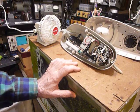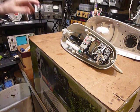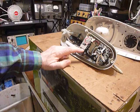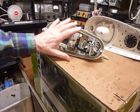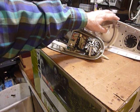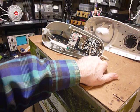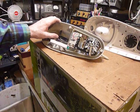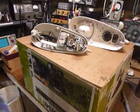So what happened? Well, I'll tell you, when I came down here to get it, I still had the batteries in there. I'd cleaned that out and put fresh batteries in, put my silicone grease on the batteries like I showed you, and put this together. I found out that this unit here is working. It's separated from this up here, so it won't show airspeed, but it's working. It started reading the wind direction, and this works too. I flipped it back and forth, and I noticed the rain gauge was working.